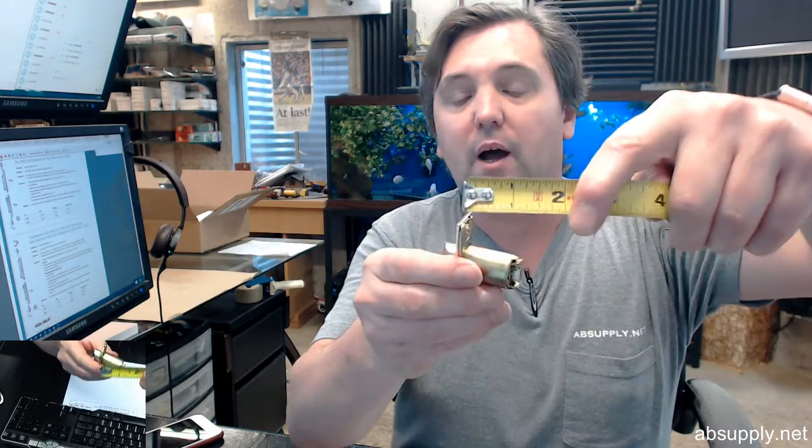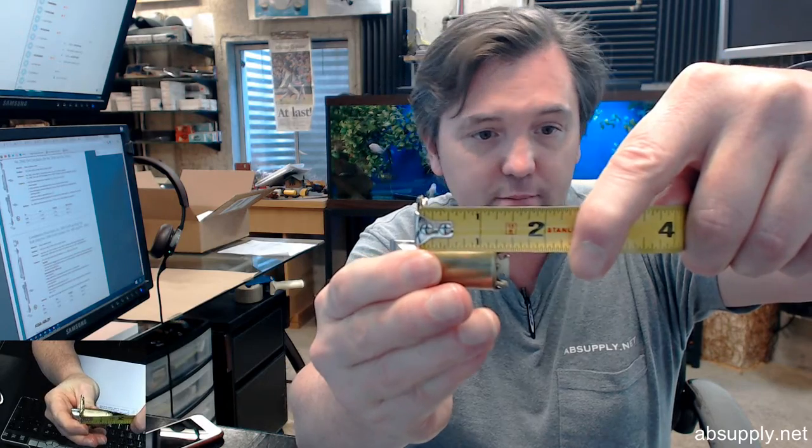Now, there's nowhere on here that you can measure 2 3/8. There just isn't. The face of the latch to the back of the chassis is about 1.5 inches. A 2 3/4 latch will certainly be longer. This housing will be longer. How you measure a 2 3/8 is just simply the edge of the door to the center of the hole that's been drilled in the door. It's really not the edge of the door, because if your door is beveled, are you measuring on the big side or the small side, the push side or the pull side? The backset is actually measured from the center of the thickness of the door to that center line. Not to make this an unnecessarily technical explanation, but nonetheless, it's nice to know.